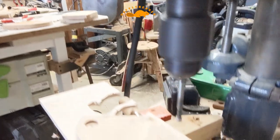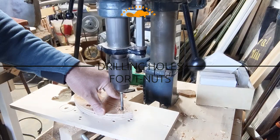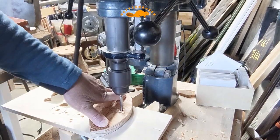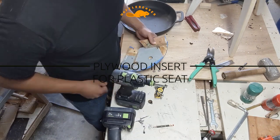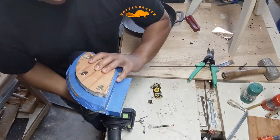This plate that I'm drilling holes into right now is going to have T-nuts, prepped in a three-hole pattern. It's going to be embedded into the plastic seat top so that you won't see fasteners in it when looking down at it from the top.